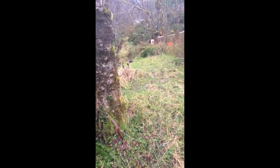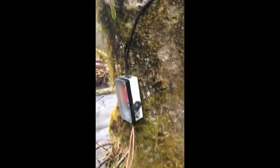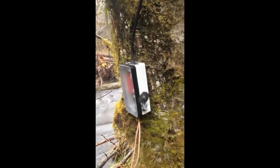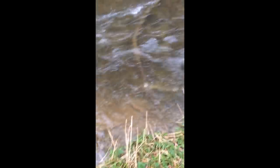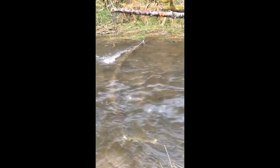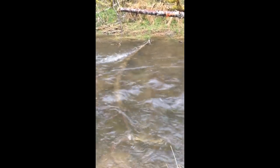While we're waiting for the glue to dry, I'll show you some of the instrumentation. This is a tuning box. You see the black wire coming in from the box housing our data logger, multiplexer, batteries, and now the hookup from the new generator. These wires coming out the bottom are basically the antenna, and they go into the creek. The idea is that current goes through the antenna, charges the little PIT tags, which then send a signal and ping the antenna as they go skipping by.